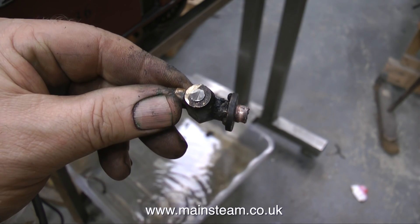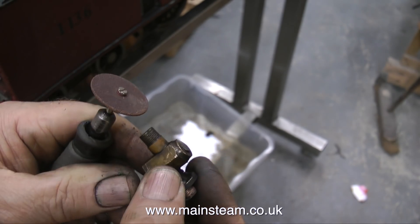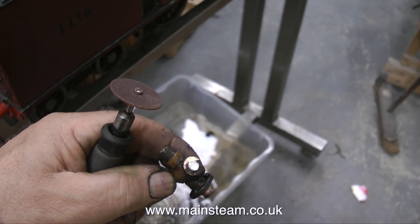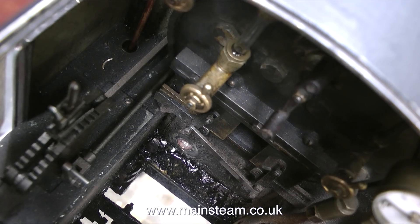When I finally carefully removed the blowdown valve from the boiler, the threaded part that goes into the boiler was almost non-existent. I ground off the top part using a Dremel tool and it took a while and was very nasty. When I got the part out, the threads had more or less disappeared. This is common in old brass fittings — brass is not a good material for boiler fittings because over a long time period when fitted to a steam boiler, the brass becomes very weak and brittle. To finish the job, all we need to do is fit a commercial blowdown valve after cleaning out the threads in the boiler.